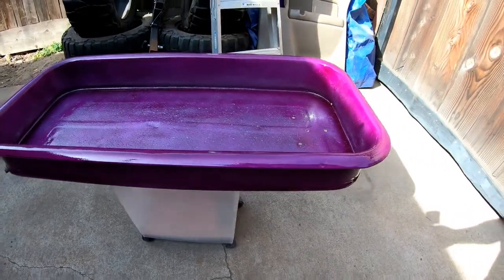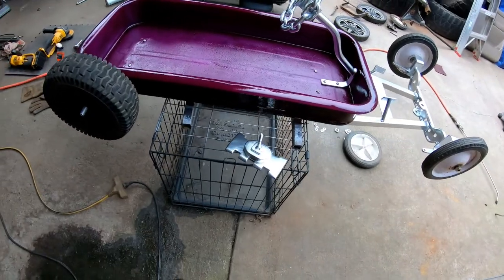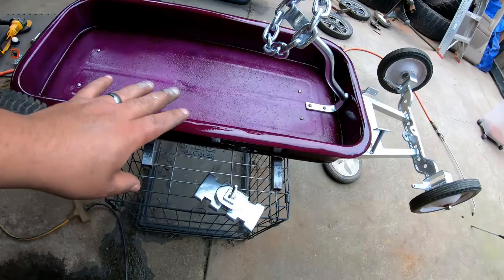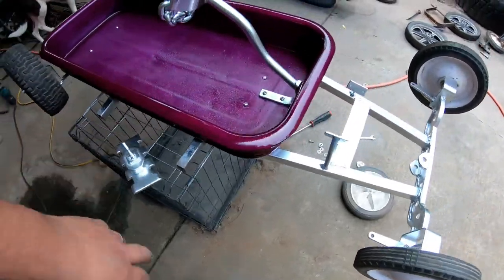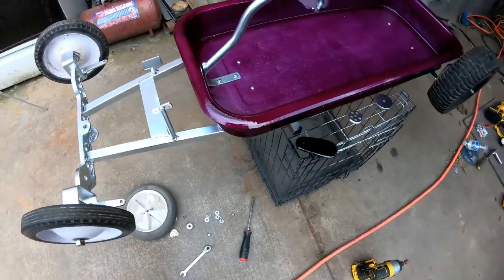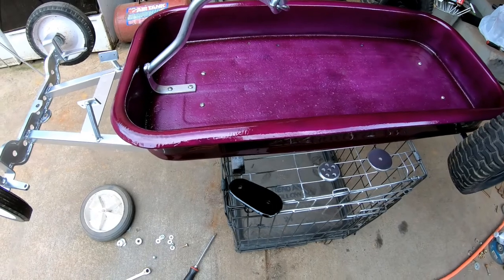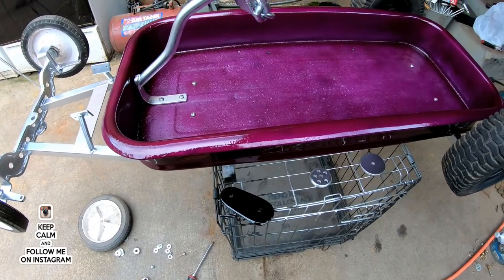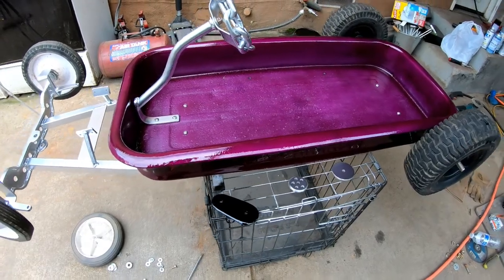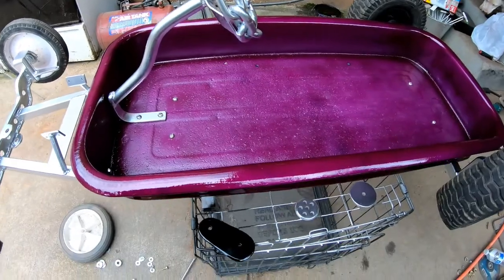It should look good. So alright guys, I'm coming along pretty good. One thing I need to mention is that spray paint is definitely not easy to use. I practically ruined it. Then I waited for it to dry, then I sanded down a lot of the areas that were dripping, because if you accidentally leave it for a split second too long as you're passing and you slow down, that will definitely generate paint drips.